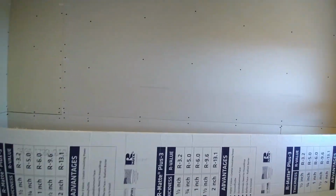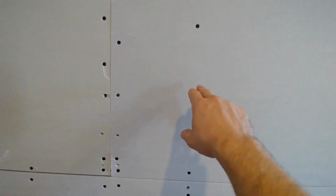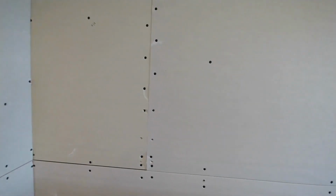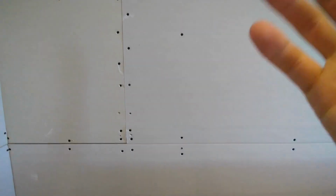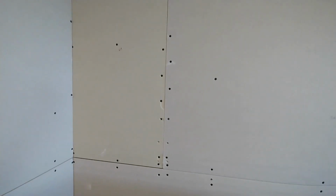So now for our mistakes. This was a full 8-foot piece, and we realized that the studs are 16 inch on center. The TuffShed is really legit. Like, it's framed very well, but the studs are placed for the exterior siding to be able to meet in the middle, not for drywall. So we put that first piece up and realized it because we couldn't get those two to meet in the middle.